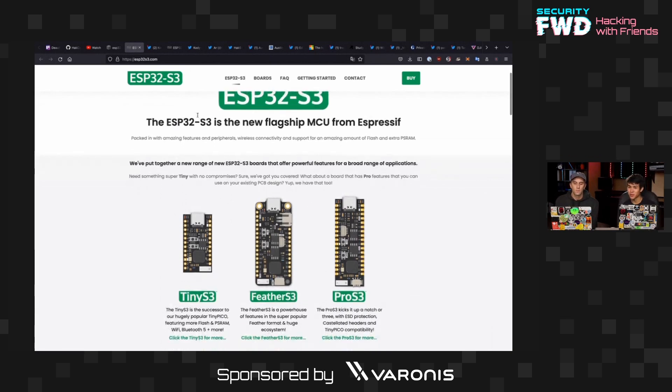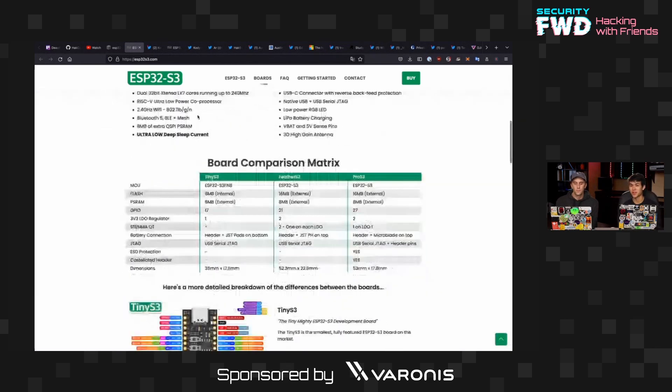One thing Bluetooth would be useful for is geofencing. There are already existing payloads for that on the Bash Bunny, which is really interesting. There's the possibility to do Wi-Fi geofencing — detecting a device by its MAC address — but if a device has MAC randomization, that wouldn't be as effective, and that's super common. Bluetooth devices can randomize too, but for whatever reason they generally don't. Your headphones, police body cameras — all those things have Bluetooth but don't randomize their MAC addresses. So you can do wardriving for people's Bluetooth devices like car stereos that don't change their MAC address very often, if ever. There's a lot of interesting stuff you can do with Bluetooth sniffing, identifying, and geofencing.